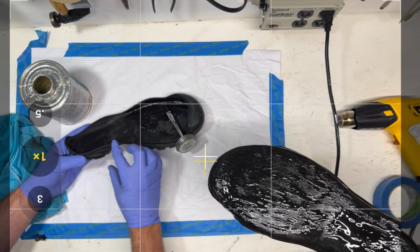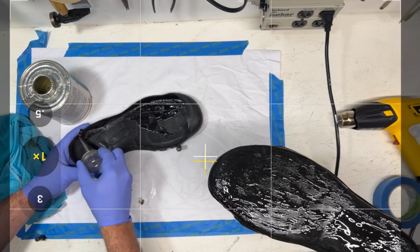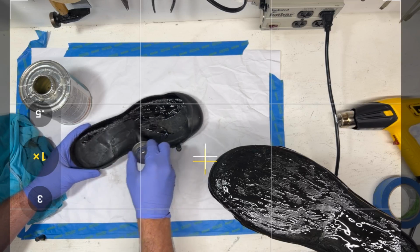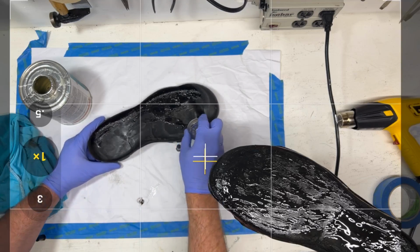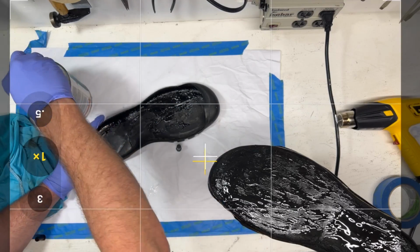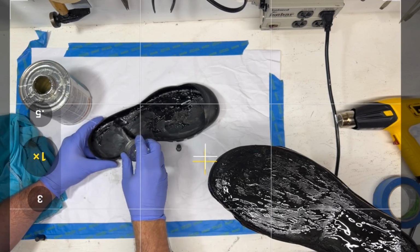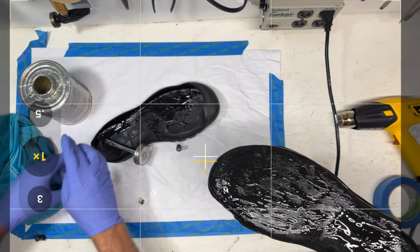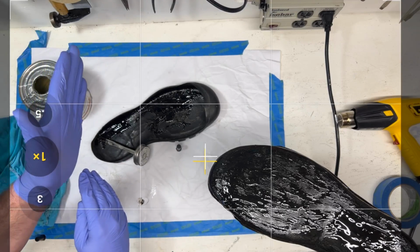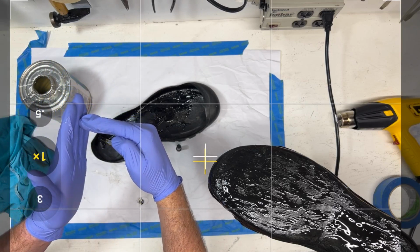The side part here, it's a little bit raised, and that's what's going to make this thing really stick together well. When you're designing an outsole or midsole, you want to be careful. As a young designer, I made this mistake where you're tempted to let the rubber sidewall come down really low, right? So you go from having a vertical bond or horizontal bond to having a really short vertical bond, right?